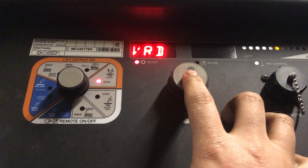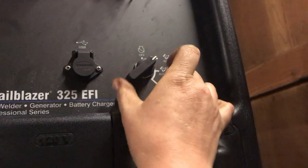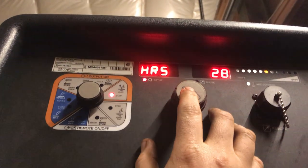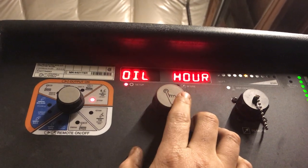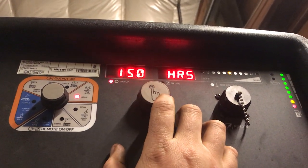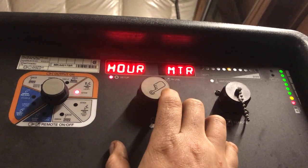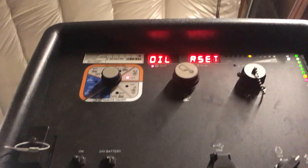There's VRD — voltage reduction — which reduces the open circuit voltage. You reset your oil hours through this menu. On the older machines you'd just click it back and forth a couple times. You can access the hour meter with the machine running and do all this with the machine running. You can also set your oil change interval — it goes up to a thousand hours, though I'm not sure why. I've got mine set to 100 hours.